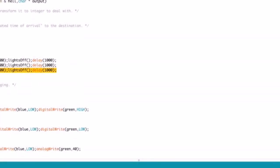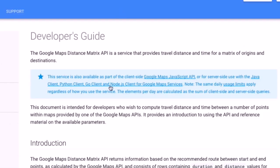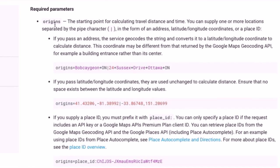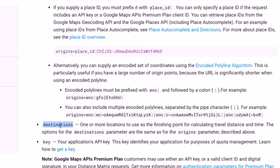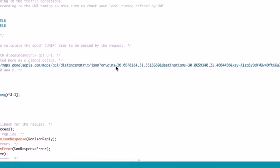Now I'm going to give you a quick overview of the code, and you can check the full instructions from the link below. First, we're going to include the OneShield library, the Internet Shield, and the Clock Shield. Fetch the Distance Matrix API and grab the request URL. The URL request must have some parameters like the origins, destination, and your API key. Add the origins and destination values in the URL as parameters.